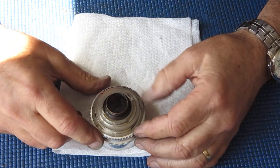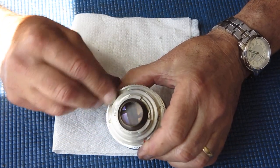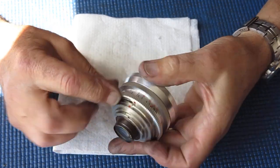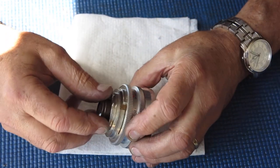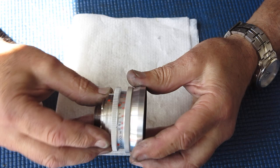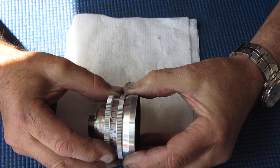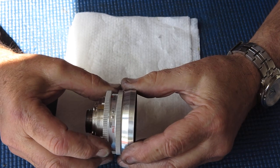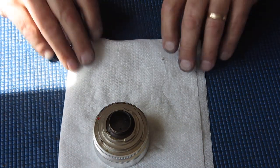Its most notable features are that the aperture is slightly sticky, but the other lever — which shifts the depth of field pointers and also sets the aperture to its maximum setting — is gummy. The lens has quite a noticeable rattle to it, which tells me that things are not as they should be.